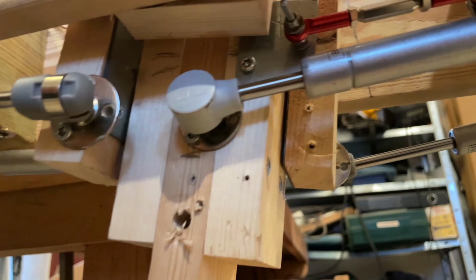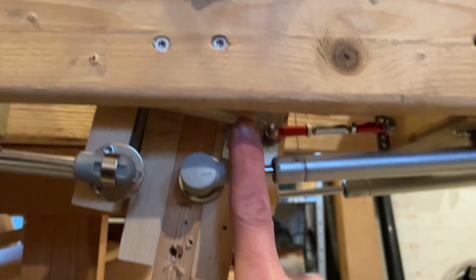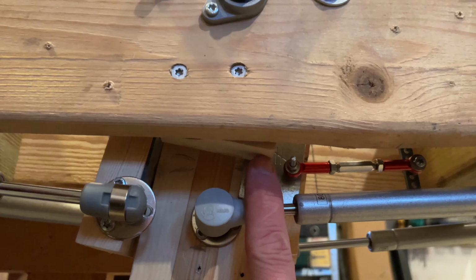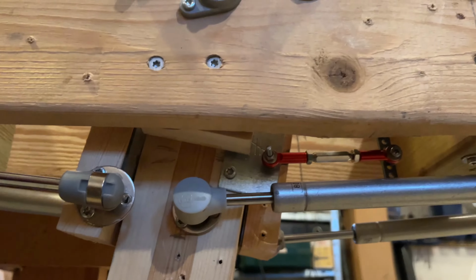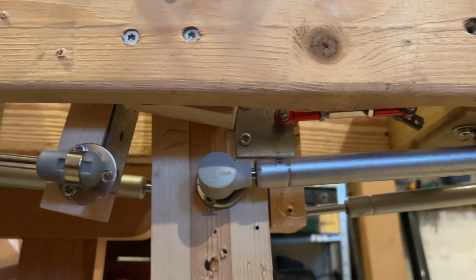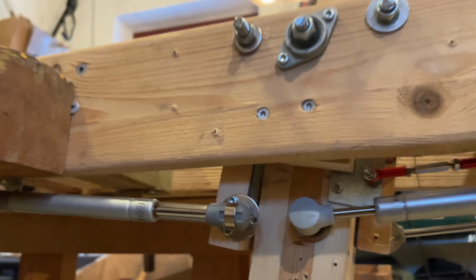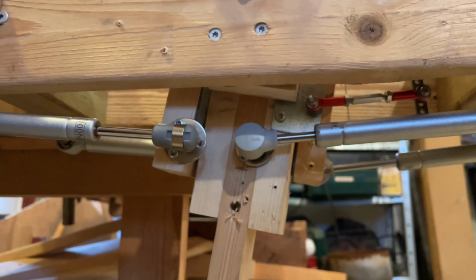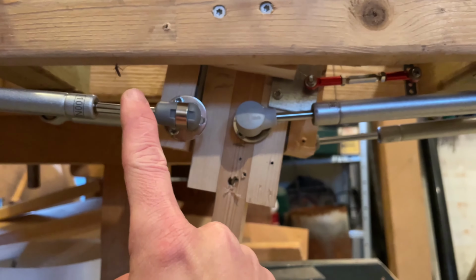Okay, and this keeps it in place. And of course, this piece of wood down here needs to be angled at the 8 degrees. Otherwise, it will not work. But when you get this at the 8 degrees, and it acts as a stopper for these 2 levers, it always goes back to the correct angle. And look, mosquito, November.